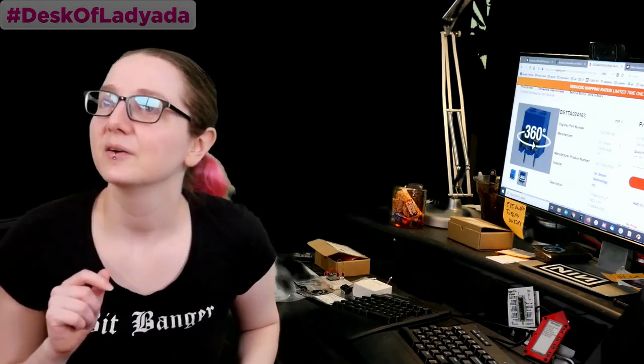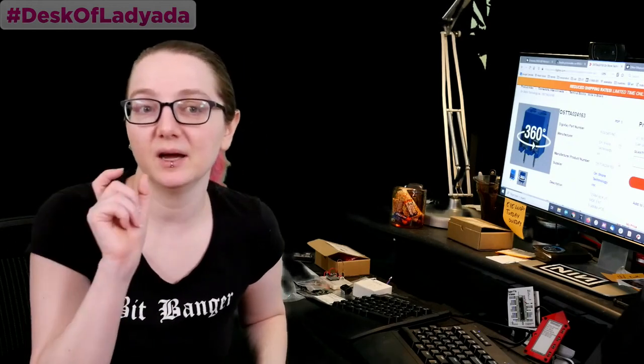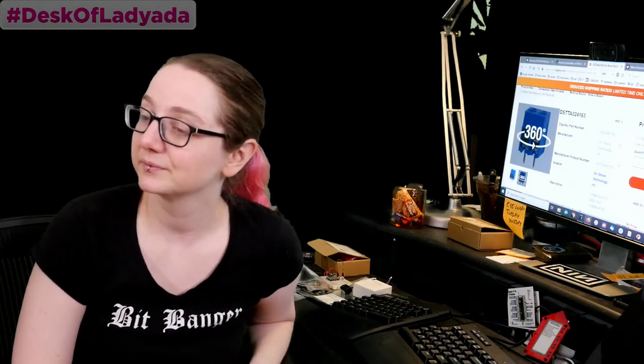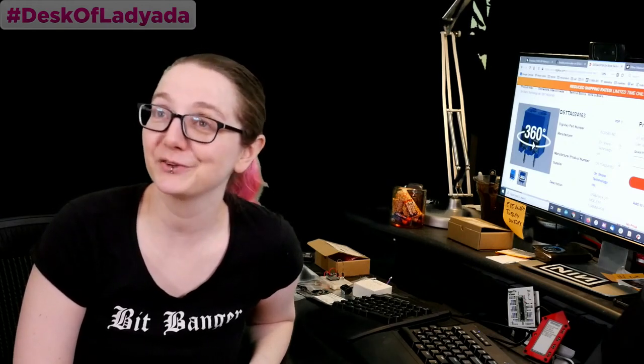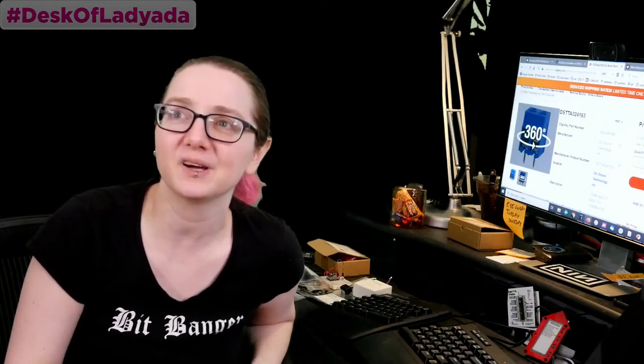Is the 5.0 mm a freedom-unit conversion? It's 5.08 mm pitch — that's the pitch between contacts. To match your PCB, just make sure you use a footprint with through-hole pads at 5.08 mm, otherwise known as 0.2-inch spacing. Are there screw terminal blocks where you can tighten by hand, like thumbscrews as in audio speakers? I bet there are, and some people also like the push-connect type, though I find them firm. There are ones that don't require special tools.